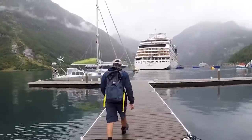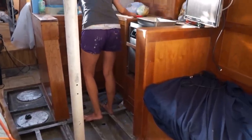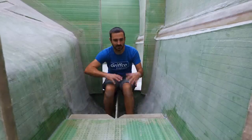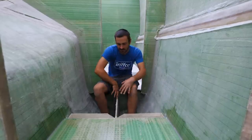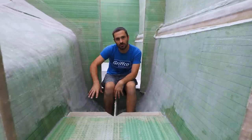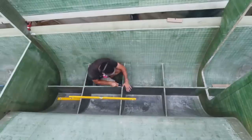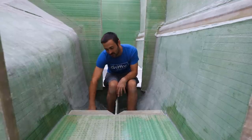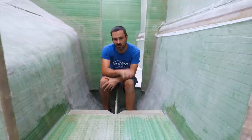On Elements, our last boat - the aluminum boat - we had a double bottom built in there, so we did have that redundancy. But that was a big area. If we were to puncture just a small area of the hull, it was going to fill up a real big area of the boat. The benefit with this is we have these webs - pieces that go fore and aft and transfer side to side - making these individual cells. So now if we were to puncture this area right here, instead of filling up the whole under-floor area from bow to stern, it's actually just going to fill up just that one cell. But we still retain that buoyancy throughout the whole boat.